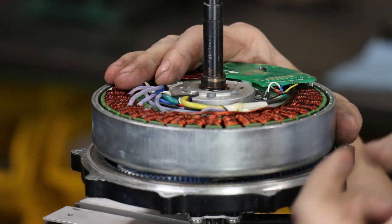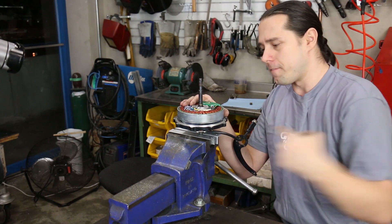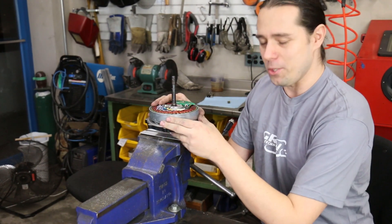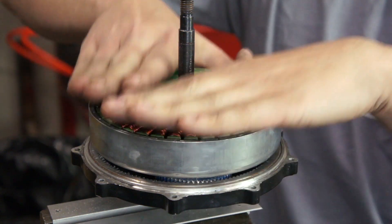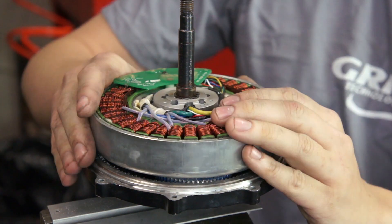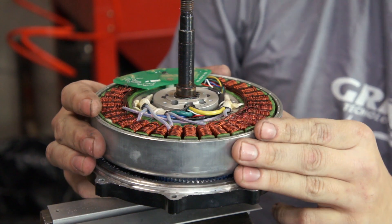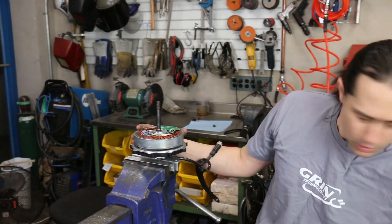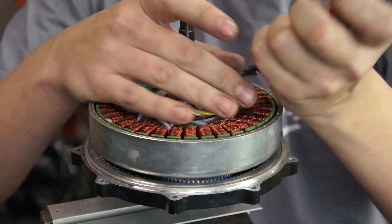The GMAC has a tricky combination of a very narrow axle bore, a very wide motor cable, and a few very sharp 90-degree bends that the cable needs to make in order to get where it's going. Even once it gets there, you have a real clearance problem over the top of the stator where all your joinery needs to be very flat and flush to the surface of the coils. We'll begin by removing the old motor cable with a couple of strategic cuts.